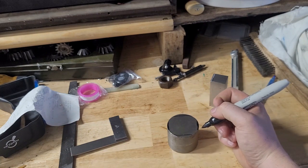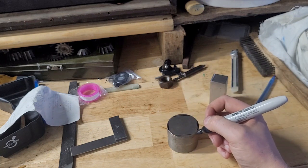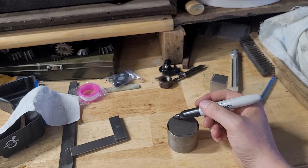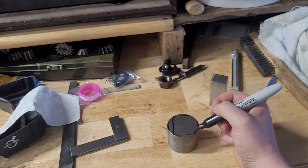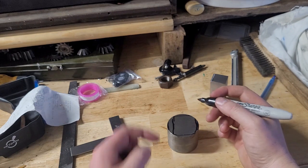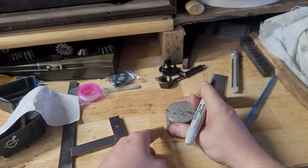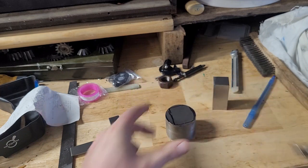Give yourself a square surface to rest on and mill this 50 or 80 thousandths of an inch deep. You still get some rolling in this corner here, but you would ideally make it perfectly square. Or rectangle works. It doesn't really matter if it's rectangular or square, just because you don't want it rolling where if I have a height differential here, the part tends to do this, and it can be pretty unpredictable.